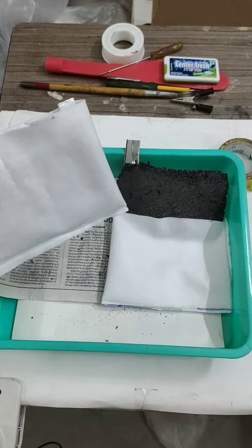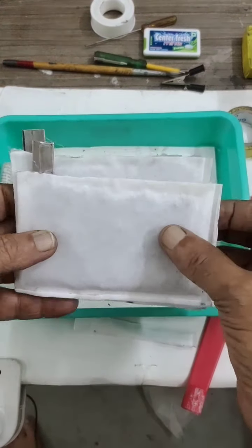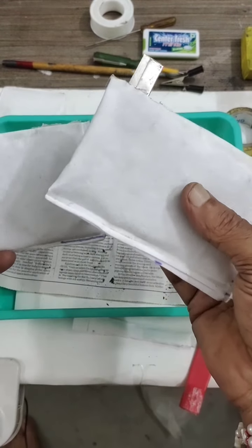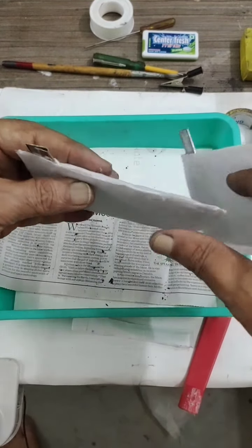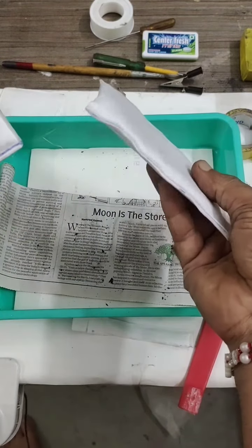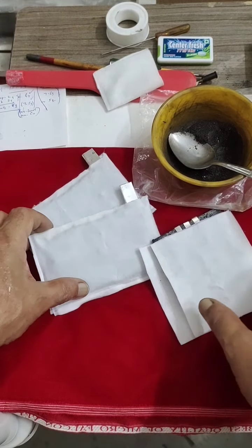After finishing, finally the negative electrodes, you can see those carbon pasted aluminum electrodes. I have slowly inserted them into this polyester bag, and on the upper side also, using the glue gun, I have sealed it. You are able to see the electrode terminal alone comes out, so it is sealed. So these two negative plates are ready.